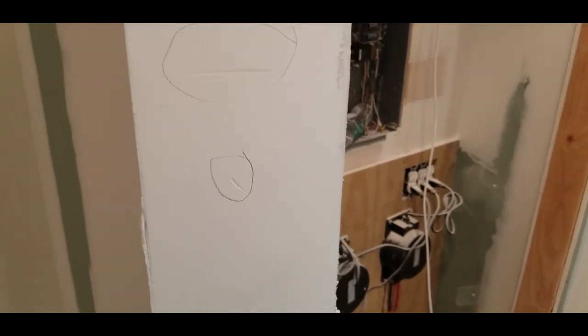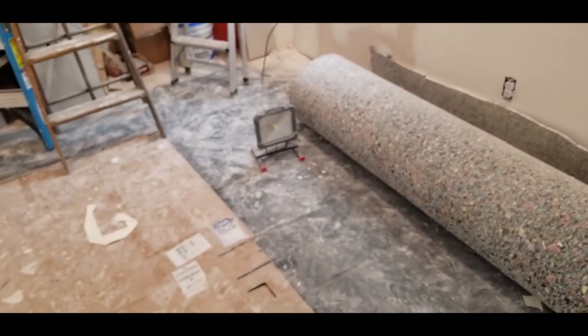It's also smart, after you think you got everything perfect, to take a floodlight or some kind of a spotlight, shine that around the room. And, you know, looking up at these lights, the lights blind you. You don't see very well. Turn them off and shine a floodlight around the room. You'll find more imperfections that you may have missed.